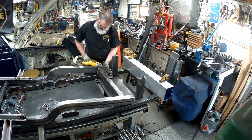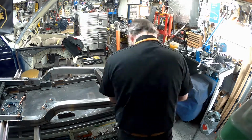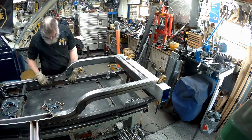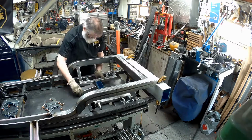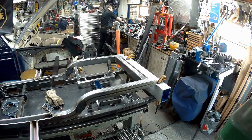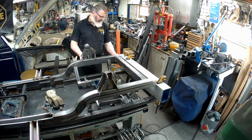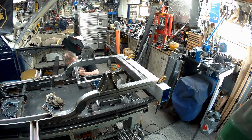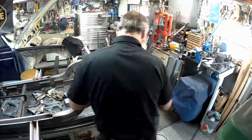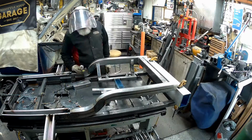Of course, the uprights that I have in there to register my frame are exactly where parts of my suspension have to go. So out came the Sawzall, and they came off rather quickly, so that little job done. Okay, now it's time to get the upper control arm brackets just simply put in place, and just a rough measurement here, nothing serious at this point, and I'm starting to map out how much of that lower control arm bracket now needs to be trimmed.